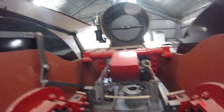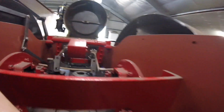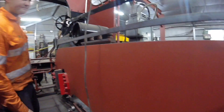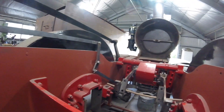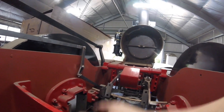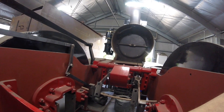Super cool. And there's fancy linkages up there that I have no idea how they work — Jared explained it to me but it's all over my head to be honest. This is basically the inside of an engine that you'd normally see, but it drives straight to the wheels. So where I'm standing is a boiler. Firebox is about to this bulkhead, and the front of the firebox will end around about here, and then it's all boiler from there — just your boiler barrel. It follows the curvature of the smokebox around and meets the smokebox, and then it all vents out through tubes in the boiler and up the funnel.